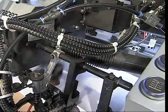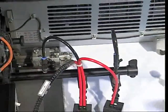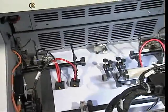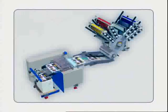This high degree of flexibility regarding materials for printing is achieved by means of a high-performance stream feeder with back-edge cutoff and with a unilaterally supported feeder head and the quadruple central printing cylinder. This means that when passing through the machine, the sheet is only slightly curved. This is crucial for both cardboard and plastic.